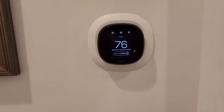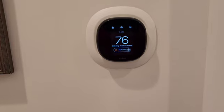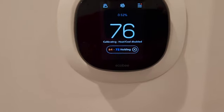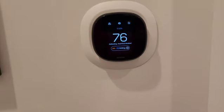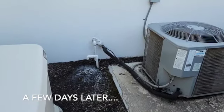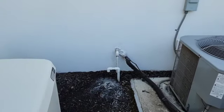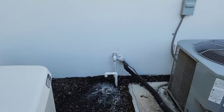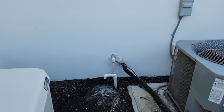We're back downstairs from the attic. I replaced that float switch, the light was off, and I powered the system back on. You can see my Ecobee thermostat has booted — it currently says calibration. After a few minutes it'll eventually turn the air conditioner on and we'll be back to normal. Well, it turns out it wasn't just the float switch. I still think the float switch was part of the problem because it was too sensitive, but I let it go a few days with the new float switch and found the system turned off again. This time the water was higher and the float switch worked as it was supposed to.